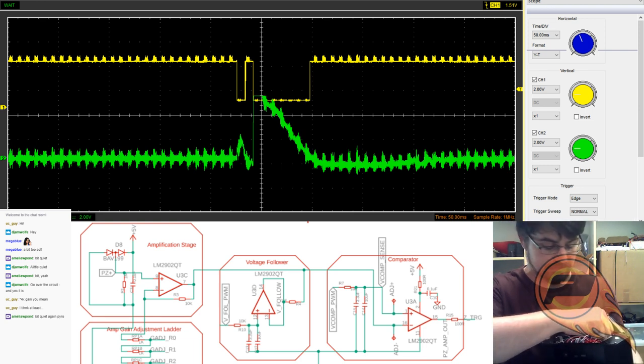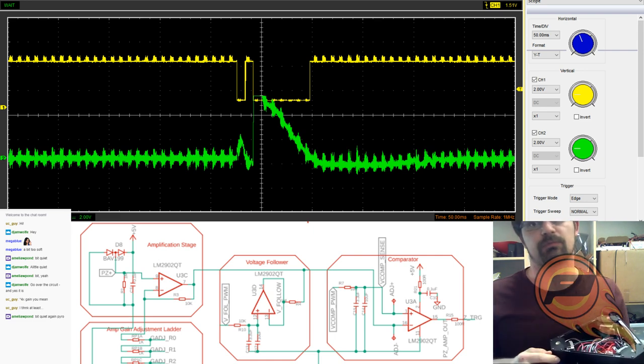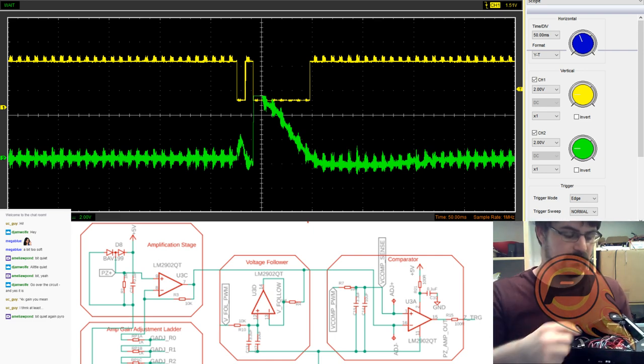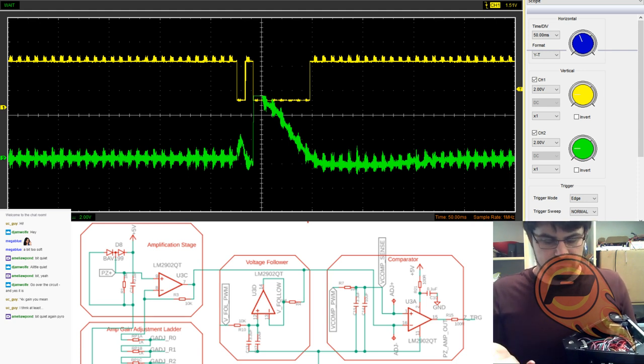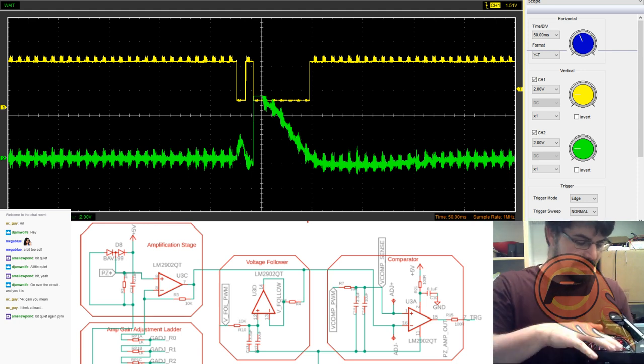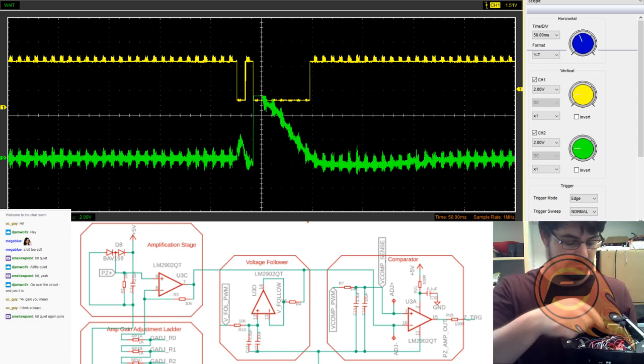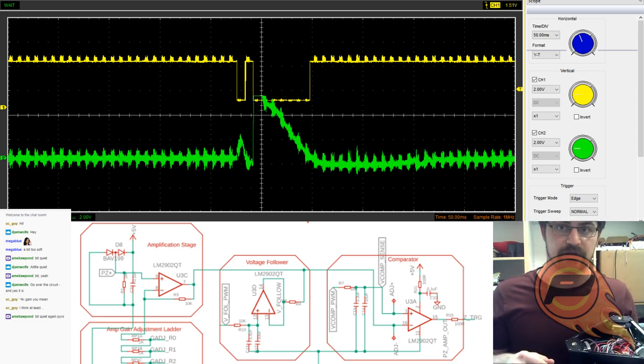The only kind of stickler with that is that I had to populate a pull-up resistor that was currently unpopulated, so that I could power it off the same connector. Not necessarily going to be easy enough for the average user to do, but I'm sure I could figure out a wiring harness that would let me just have an easy drop-in for this kind of a printer.